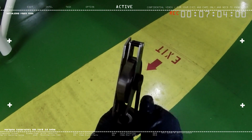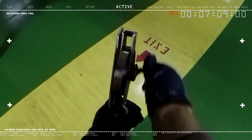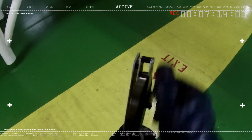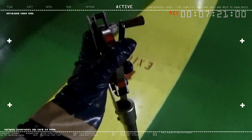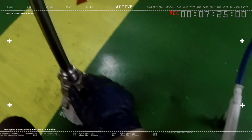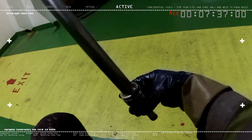Okay, well, that is very long, it's not really easy to reel in 22 meters of tape here. See that sound? So in securing that, we have to hold the tape here and then close the sounding pipe. And then you have to hold the dipstick vertically so the measurements would be accurate.